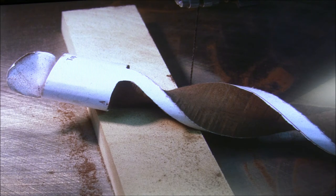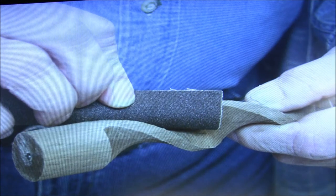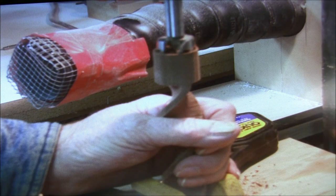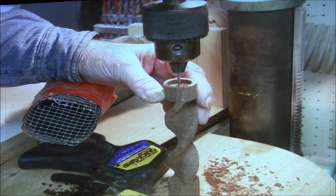After we got both pieces cut and out, that's a little round drum sander on a drill press to sand the inside. Or you can take a dowel, wrap a piece of sandpaper around it, and do it by hand — the dowel will save your fingers. That's drilling your hole — be sure you use some kind of clamp to keep that blade from twisting. A little twist and it really hurts your hand. That screw is going to go down into that thin piece, so if you don't pre-drill it, it may split out.